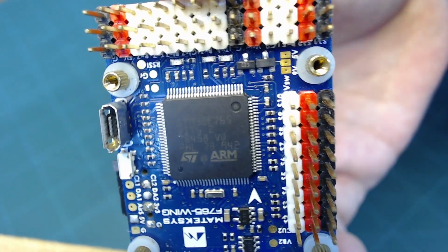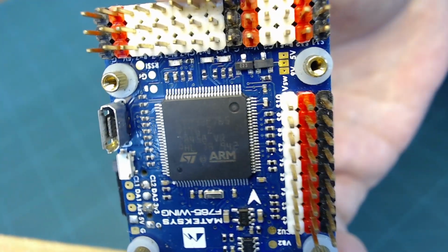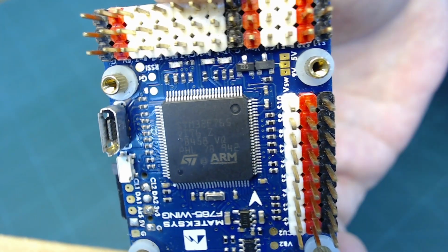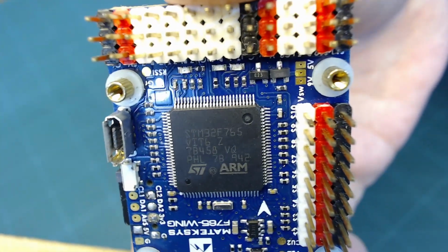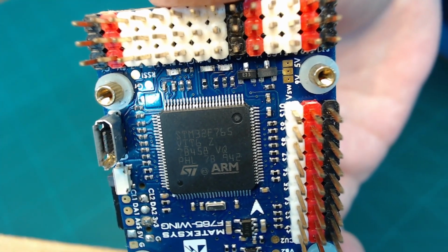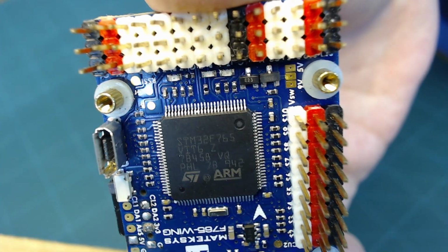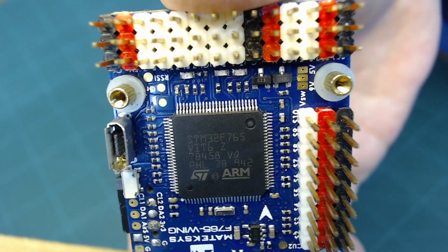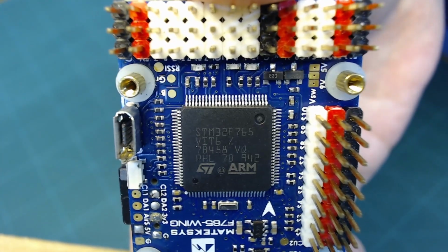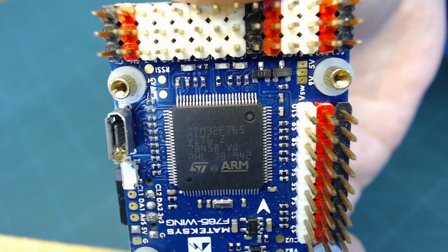The flash memory could be considered another peripheral. It's just something that's on the chip. The UARTs are all peripherals. And then there's other things like an analog to digital converter. There's PWM generators. PWM is pulse width modulation, which is typically used by servos, and it will spit out a pulse varying from 1 millisecond wide to 2 milliseconds wide to determine the position of a servo.